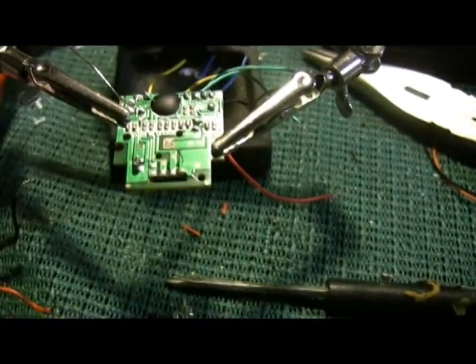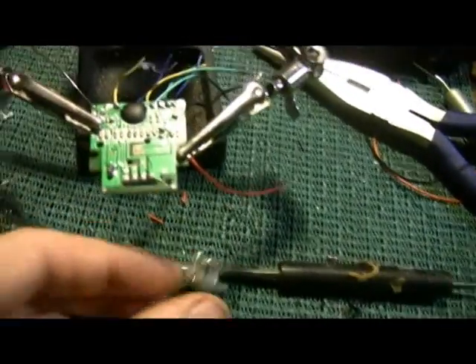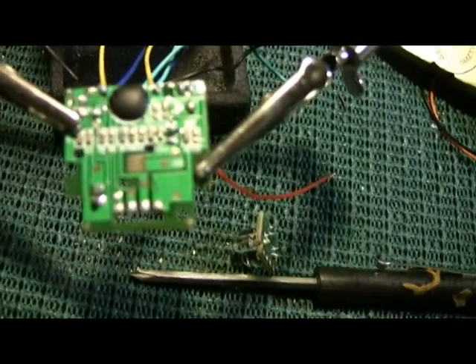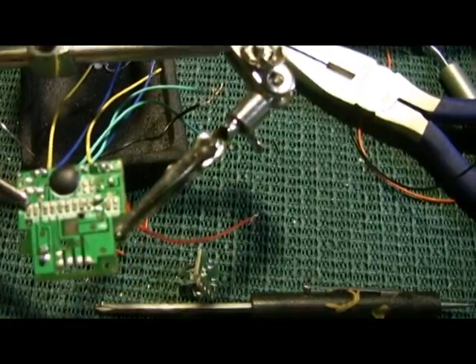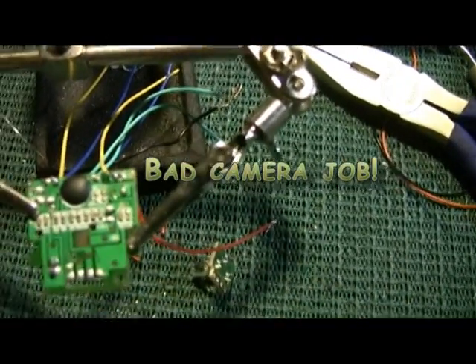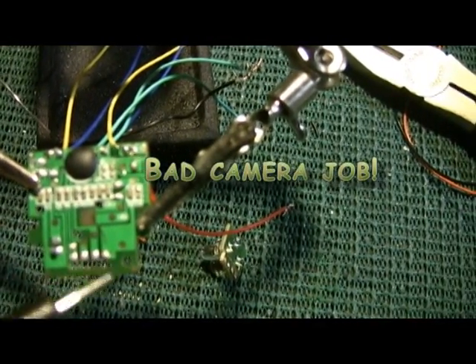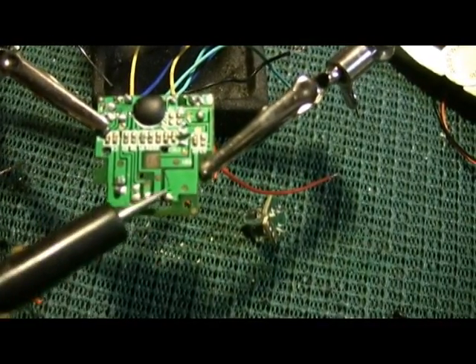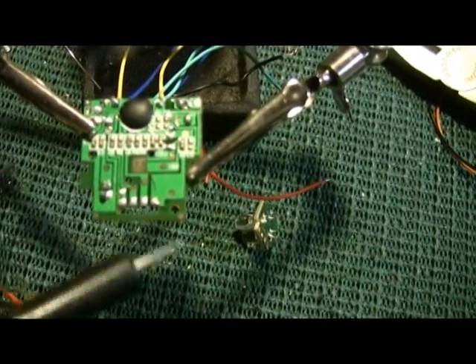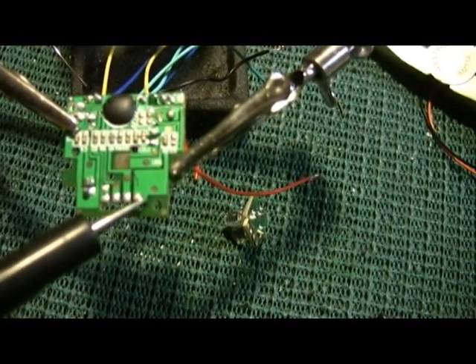I just soldered this off the board. It's attached by glue and solder points, so what you're going to do is go back and forth melting all those points, pull down on one side, then go do the same thing on the other side. Eventually the board will fall through. It'll take some careful soldering to keep the traces from merging.